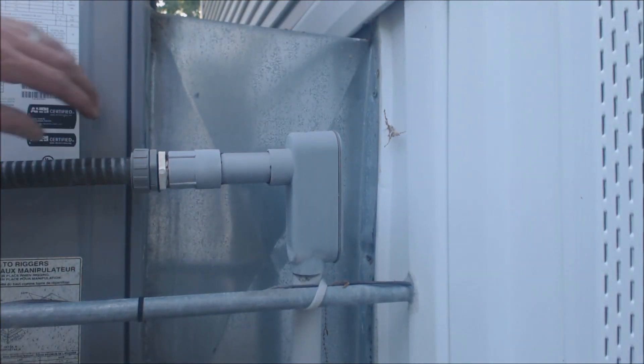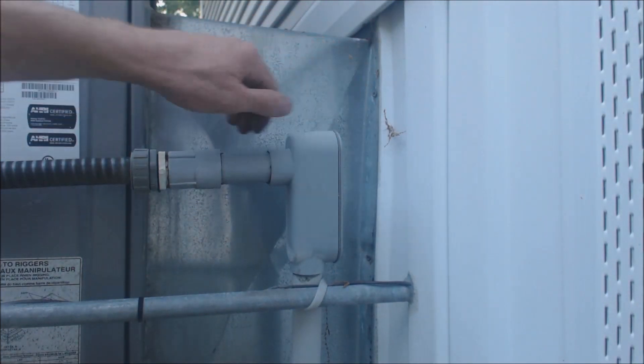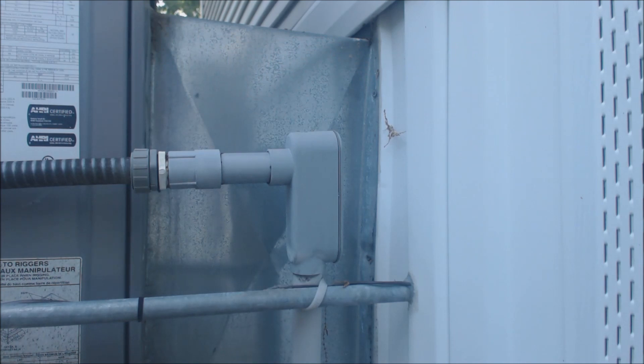You want to have enough room to get a drill in so you can screw in this way and that way, or you can use a 90-degree drill. You need something to block animals, and also for insulation purposes — to make sure that flexible ducts don't get wet or that the fiberglass wrap outside the metal doesn't get wet. This could be used at a home or a mobile home going up against the skirting. Hope you enjoyed — see you next time, AC Service Tech channel.